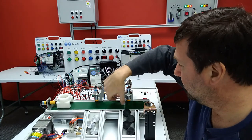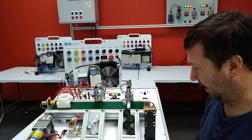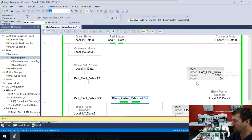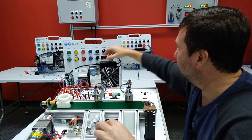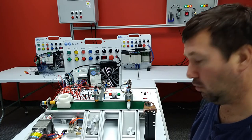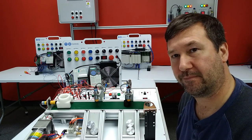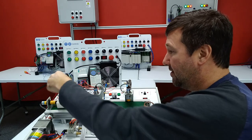Let's go ahead and download this and see how it works. As soon as we download it you notice it retracted back. So I'm going to put my part right back there, hit the green button — and it did extend, and it retracted! Now my timing is definitely off though, so I need to work on that. It looks like it came out about halfway in between the two, so let's make our Part Eject Delay 2000 for two seconds. I'm going to get the other parts out of the way since we're only using the shiny pusher right now. Hit the start button, drop our part in — the sensor didn't pick up the black part because it's not inductive. We have to use our shiny parts, so we'll drop that back in.